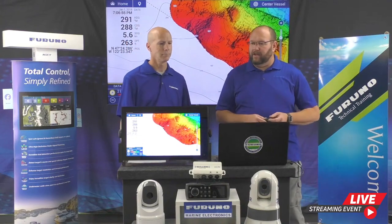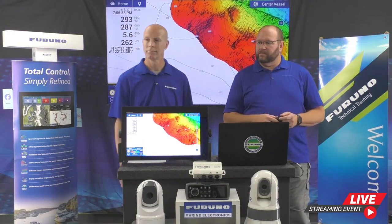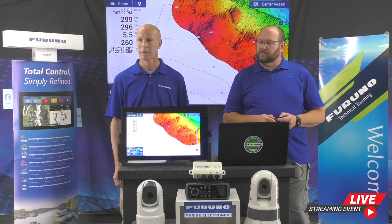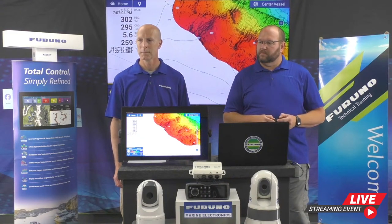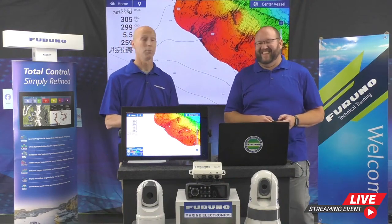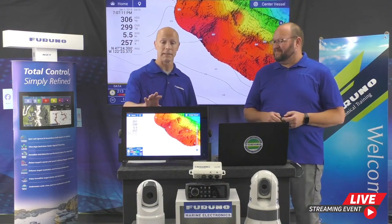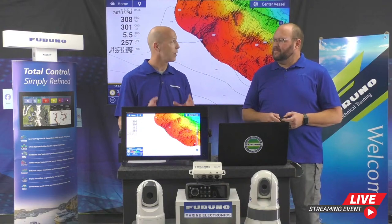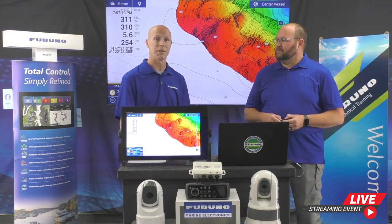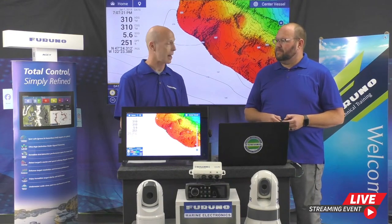So, do we have any questions from the chat? Yes. Can I take a screenshot with my FLIR camera? And if so, is that geo-referenced like normal screenshots? Absolutely. That's a great question. You're going to make me think on this one, but you absolutely can. The reason being is the TZT3 is going to screen capture whatever is on the screen at that moment. If that happens to be your FLIR camera, that's the screen capture you're going to get. And yes, it absolutely will geo-reference it to the position you're sitting in when you tap the screen.